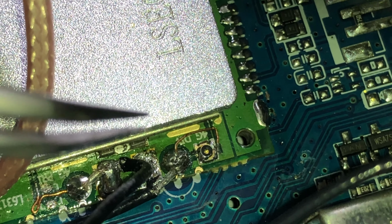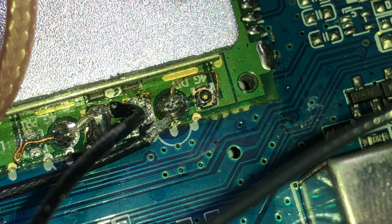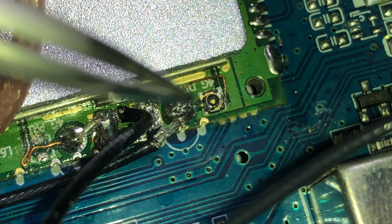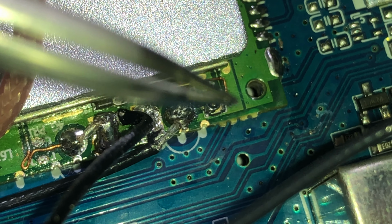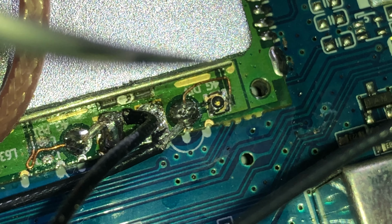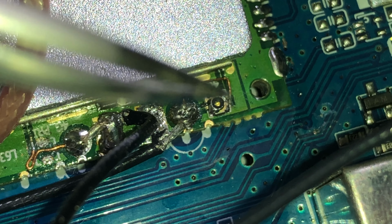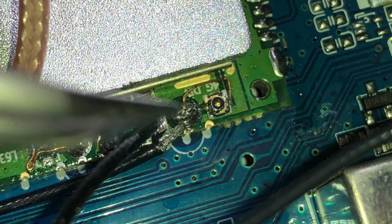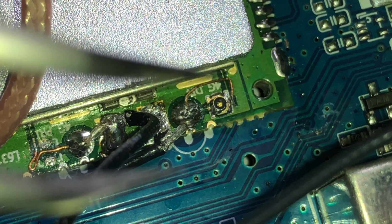and I'm going to use this example again, the trace goes to this connector and you would think that it continues to go under it and then down this line here because that's what the antenna should be. Now, if you check continuity, you'll find that this connector is connected to that trace like it should be. However, this solder point basically just goes to there and stops. It's not connected to anything.